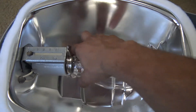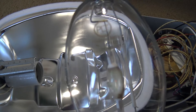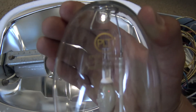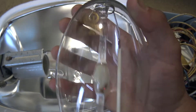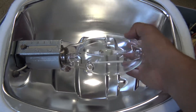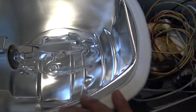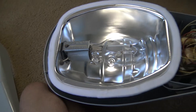The lamp in here is a pulse start lamp — it's just a PLT lamp, I think from Precision Lighting, a lamp I bought off 1000bulbs.com. They have a good selection of HID lighting still, so if anyone needs any lamps brand new, go to their website. So yeah, just a standard 175 pulse start lamp, nothing special at all. And lastly, you've got the felt gasket on here — this one looks a little bit too fuzzy, so probably over time this might degrade, but it's nice and new right now and well applied.